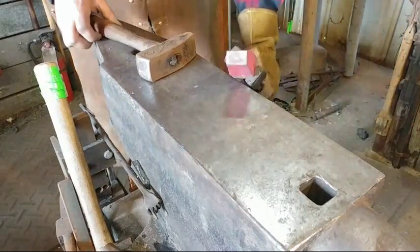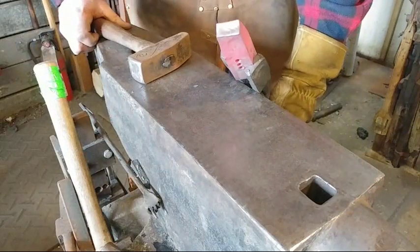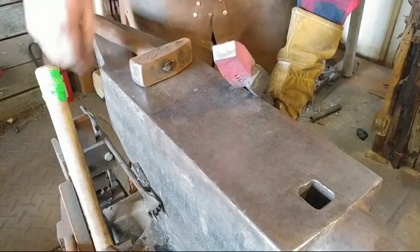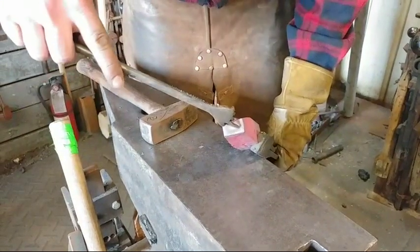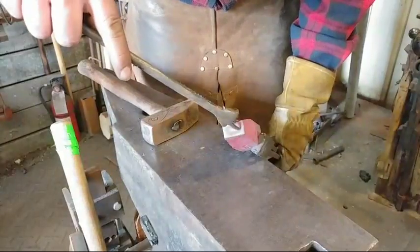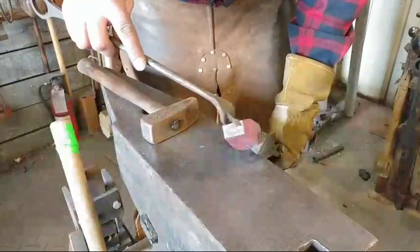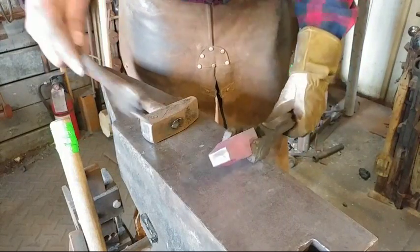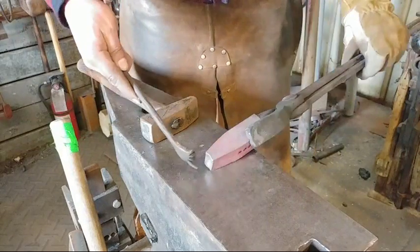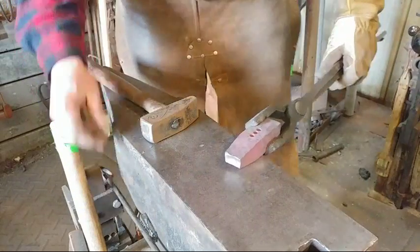There's a pucker right there in the center where I cut it off with an angle grinder — the two ends of the cut didn't match up. That is not a crack or a cold shut. I'm going to dress this back a little bit and then grind that out. That's not a stress riser or anything, it's just where the two lines didn't match.